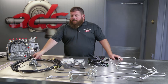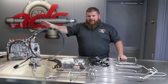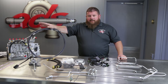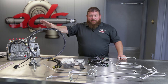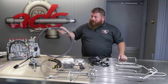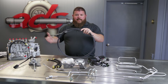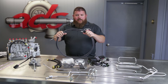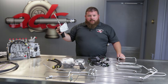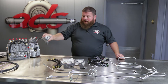So controlling the pump: the cab and the armrest or throttle lever in your machine actually has provisions for a mechanical cable — it's not used in the factory configuration. They use what is basically a potentiometer in that throttle lever, but we're running this pump by cable. Included with the kit is a high quality cable. You route this up into the cab, take apart the armrest, everything clicks together and now you have mechanical control of your pump. Also included is electric shutoff, which mounts to the pump bracketry so we now have an electric way of shutting this pump off.